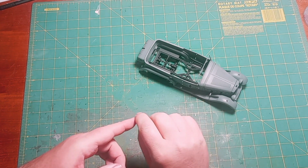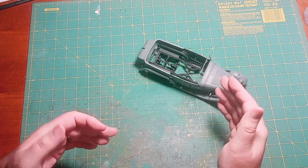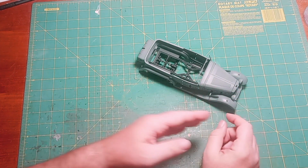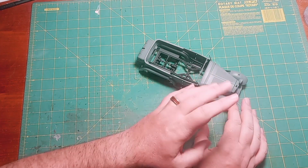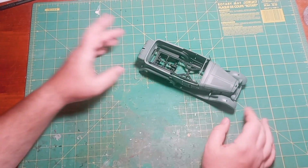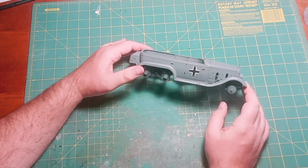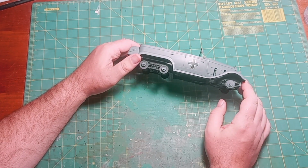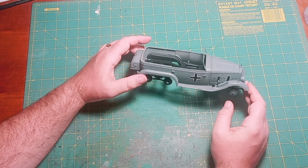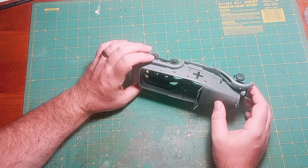When you spray, you'll watch it come out of the brush, and it gets only so far out, and then it starts to break up. If you put it right on the edge of where it starts to break up, it'll go on light and just flatten out real quick. I don't know, I'll have to demonstrate that in a later video. But yeah, it's just perfect. I'm super happy with it.